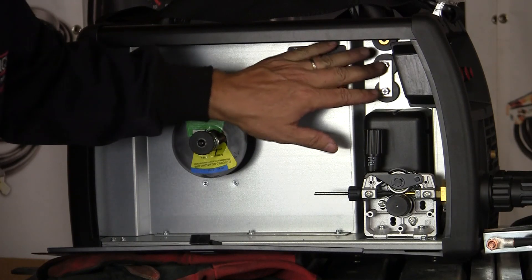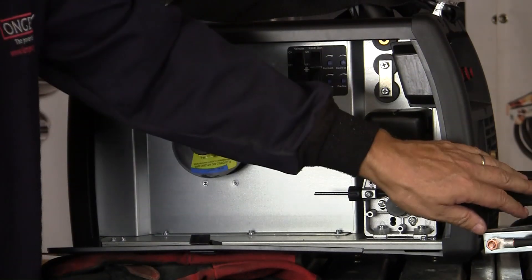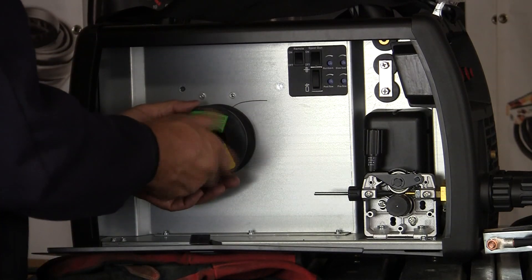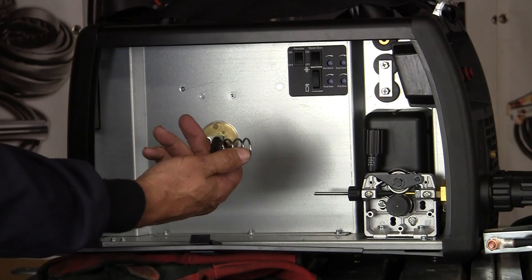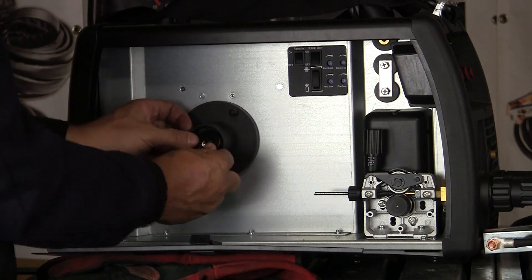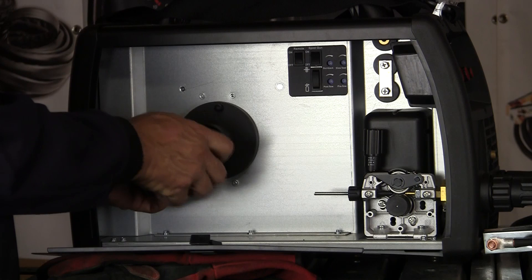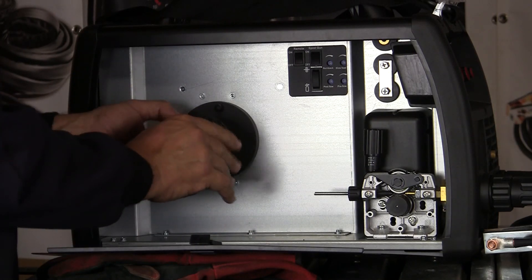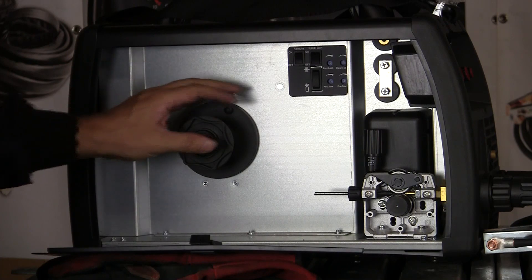This is back to the positive position again — I've switched this plate so it's brought down. So now the MIG torch gun is positive and I can switch my ground lead again, so I'm running in electrode positive now. I also wanted to show you how to change the spool. We take a small spool with its spring and keeper, then take the larger adapter, slide that on, this slides in, and then the spring and bolt thread in. Put tension on the wheel, and this is what holds your 11-pound spool on. Now I'm ready to convert to the larger 11-pound MIG roll.